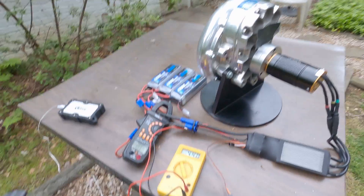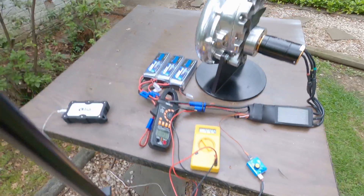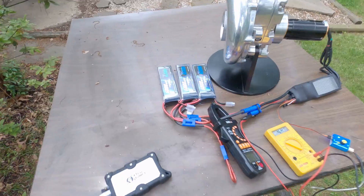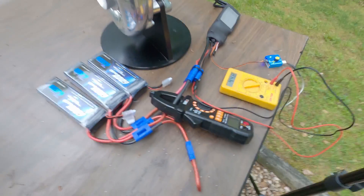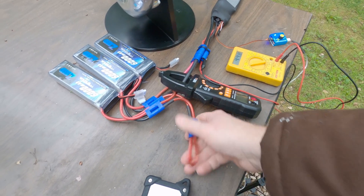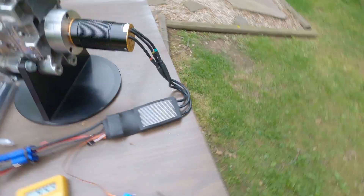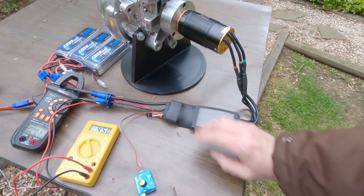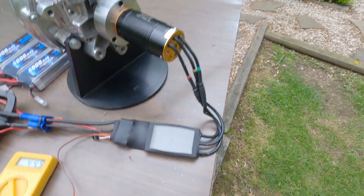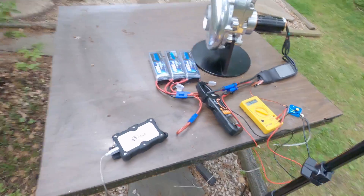That's insane. We did have a voltage drop — dropped down about 35 volts — and it was holding steady just under 200 amps. I thought ahead, which is a good thing. The face shield keeps falling down, but you'll notice this little loop. These cables are hot, batteries are warm — that's going to need some cooling. Everything's pretty damn hot, the motor is freaking smoking hot, so that's going to need a cooling fan. We have a plan for this, and of course we need to add more power.